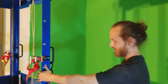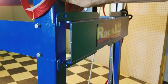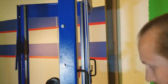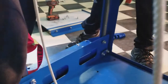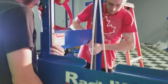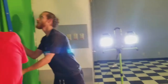Make sure when removing the side that the 2 ledges that form over your brace here are removed from the back middle brace to keep it from sticking, as well as the overhanging lip from your top middle brace. Following that, 2 people should be able to gently lift that side out and lay it against a wall or even surface so it does not fall.